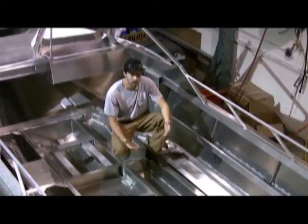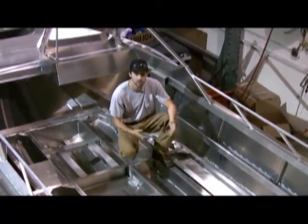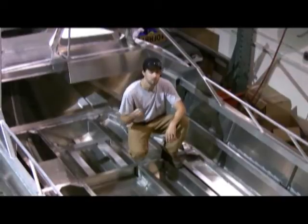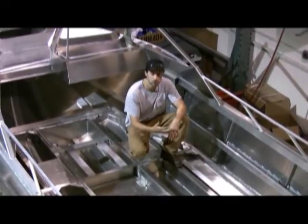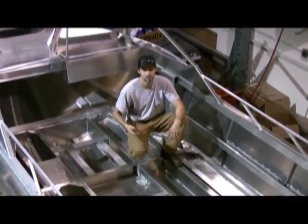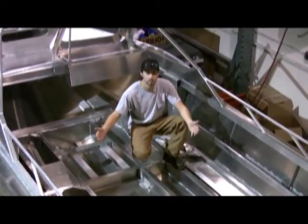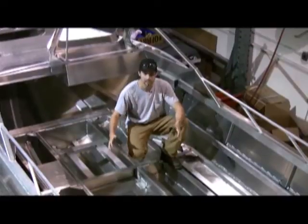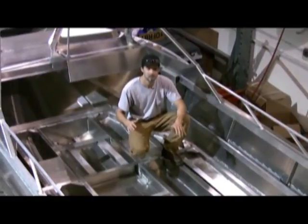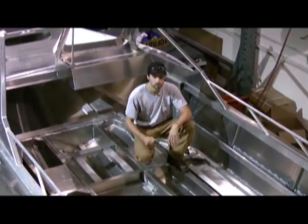That's why we can use slightly lighter skin with lots of structure — resulting in a boat that's lighter weight but, in our opinion, stronger. The lifetime hull warranty backs that up. With a boat like this, you don't have to worry about hauling heavy loads or abusing the boat. You also get a lighter boat, so whether behind your truck or out on the water, you're more efficient running, towing, and hauling loads — getting up on step easier because you're not carrying unnecessary weight in the hull that isn't contributing to strength. We want you to see this and compare it when you're looking at other boats. This is an area most salesmen don't have the knowledge to tell you about. Hope you enjoyed it.